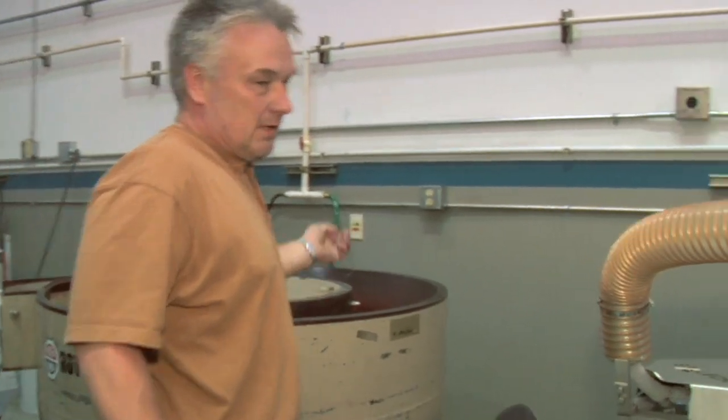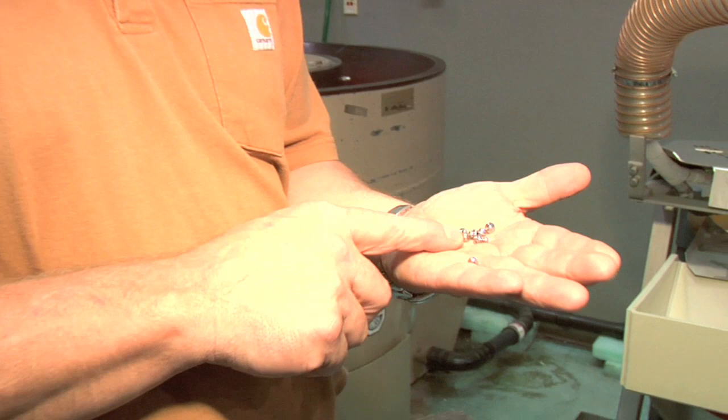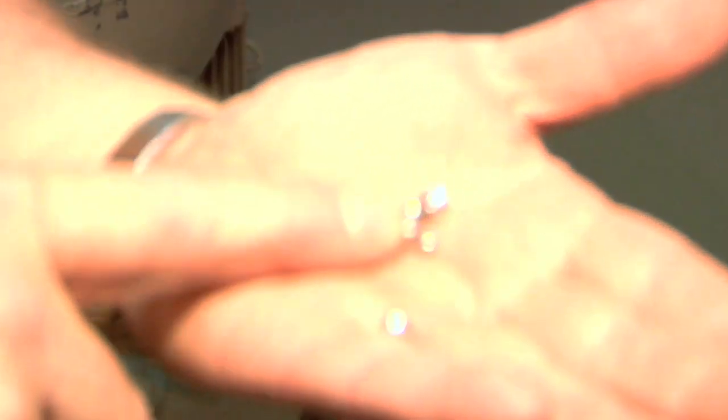The little beads are actually the polishing media. They use a 6-millimeter ball — they call these satellites. The satellites rub against the media, and by deburring and smoothing, the media makes the blanks shiny.